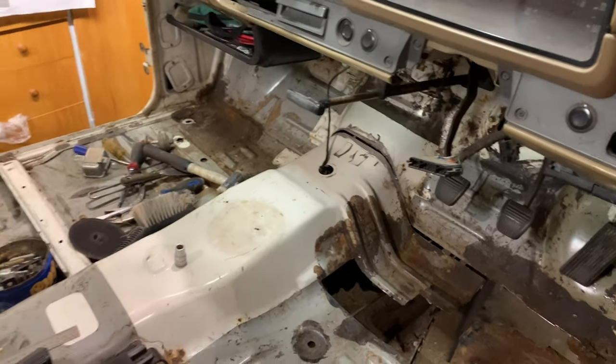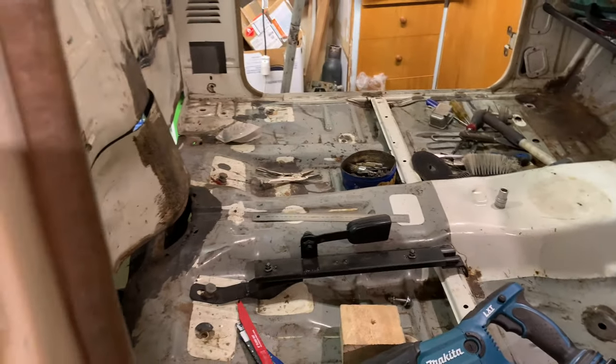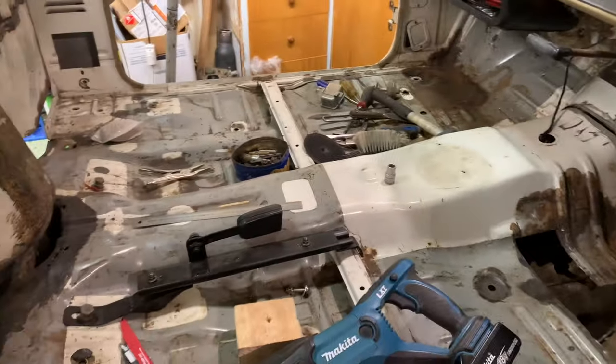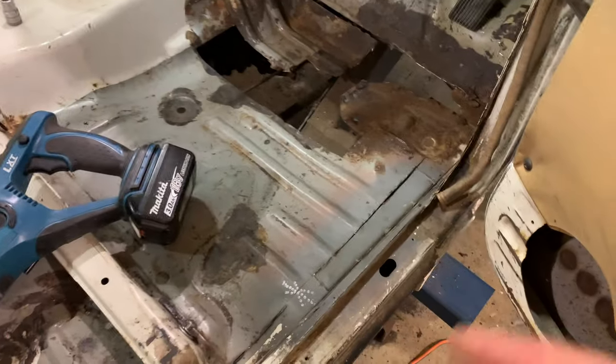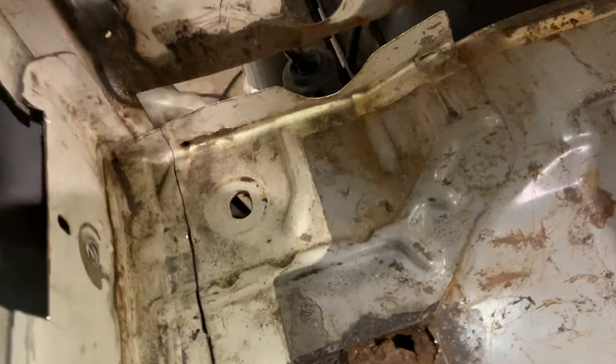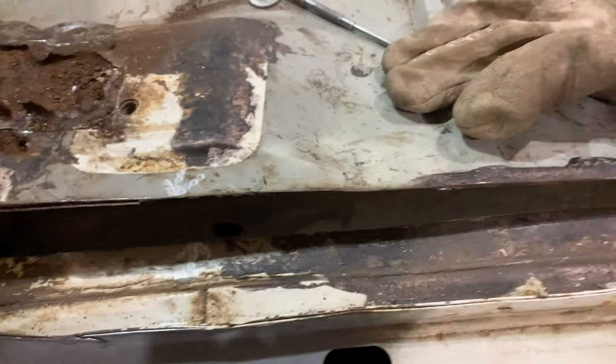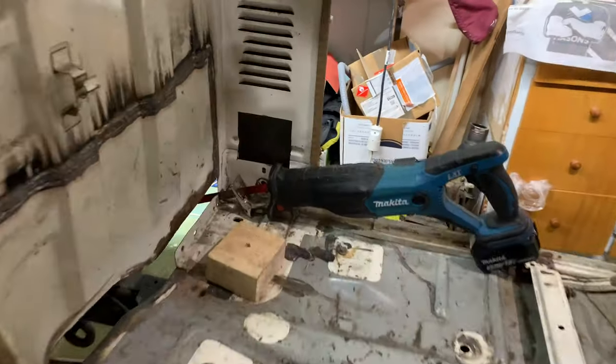The floor is going to be pulled out and I need to take the blower unit out of there as well. I'm going to take it to polytech — my school — to have it sandblasted underneath, and we're going to put the stone guard underseal on it too, leaving about 50mm clearance along the edges so it can be welded. This side is all chopped through and ready for the body drop — that's the difference with the floor level — and I'm going to join those together and start on the other side.